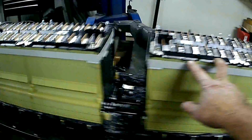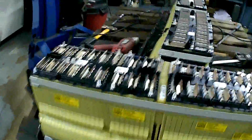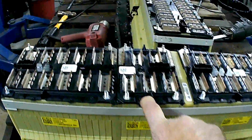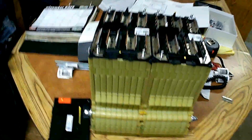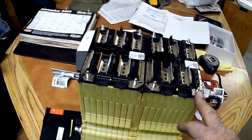I'm breaking these down into 48-volt modules. The layout is: 48, 48, 24, and on the back side 24, 48, 48. What you end up with is eight 48-volt modules total, because you take the two 24-volt modules, marry them together, and then wire from one lug to the other so you have 48-volt potential across the two outer lugs.